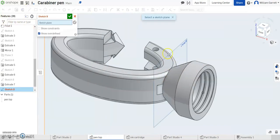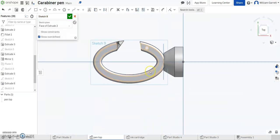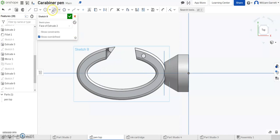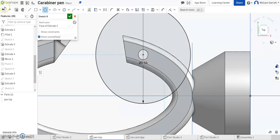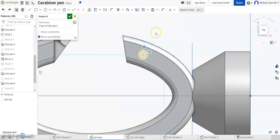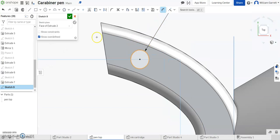I'm going to start by doing a sketch right on the surface where that hole is, and I'll turn to the top view so we can look directly on that hole. We took that piece out and measured it, so I'm just going to make sure I get right in the center of that hole and get that box centered. Our dial caliper told us it was 0.058 inches, so I'm going to redimension it as 0.058. And that gives us the size for our clip.